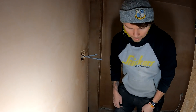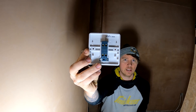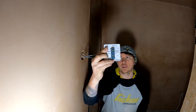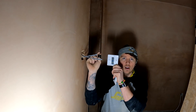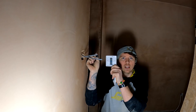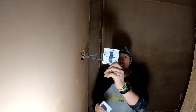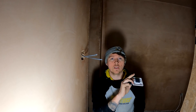Adam's asked me to show the difference on an intermediate light switch. As you can see here it's almost like two poles that travel straight through - it feels like an isolation switch, a double-pole isolator. What we do with this is: brown and brown from two cables, black and black from two cables, and then our common which is gray goes into a wago or ideal two-way connector - linked through so the common is always linked throughout. This intermediate switch acts as the isolator switching between the different switches as it works back up to the lights.